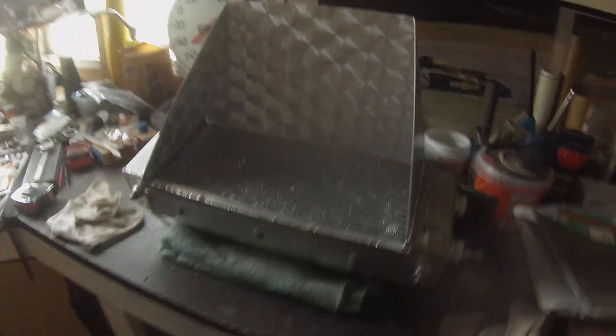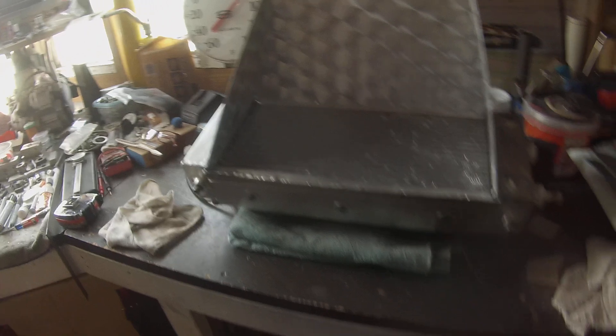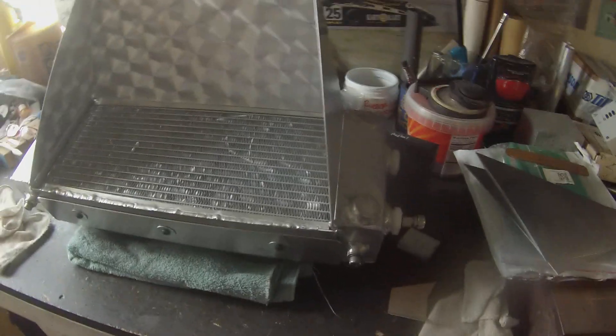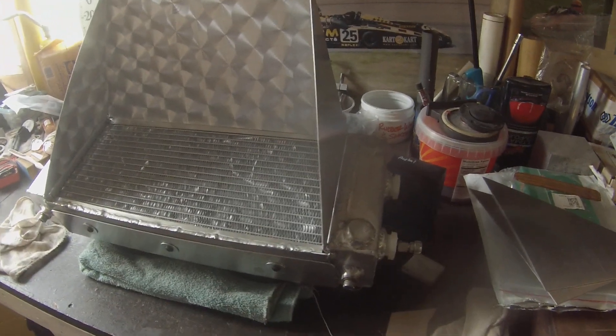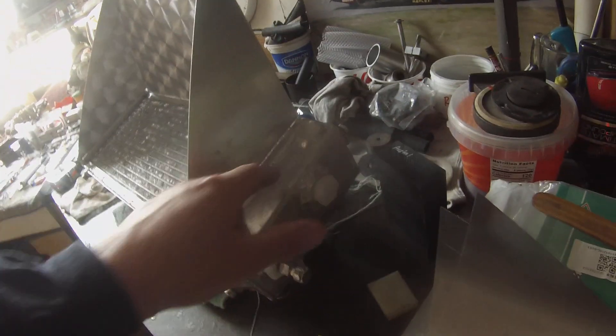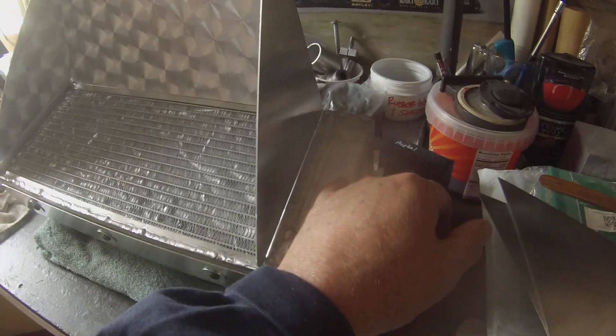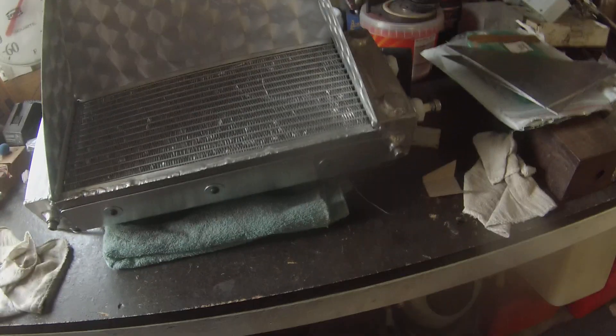I called Rich over yesterday — he's going to have to do this welding. We really want to stay away from any of the welding that's already been done, because every time he's welded near something already welded by John, it caused really super minute little air leaks. That's why we still have the fittings in — when he's done, I'm going to have to air check it again, and it may have to go back. The old aluminum nipple patches needed work, and he got into one of John's welds on the header that had a tiny little stream of bubbles. You got to fix it — it's got to be airtight.